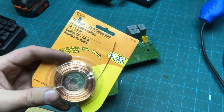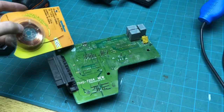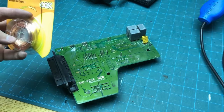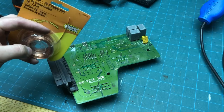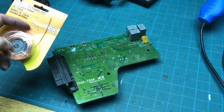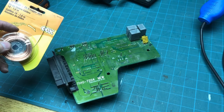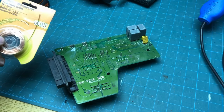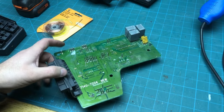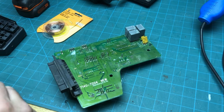The game plan is to use some 18 gauge copper wire to just jump out that corroded section right there. It should be low profile enough, and if it's close to any other circuitry in there, when it's all said and done I may just put some kind of a protective coating over it to prevent it from shorting. It's a pretty short run, it shouldn't wiggle around. I'm going to go ahead and start cleaning this up a little bit, scrape off some solder mask, and get ready to fix this.